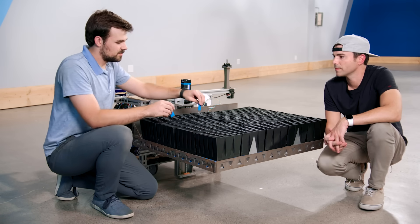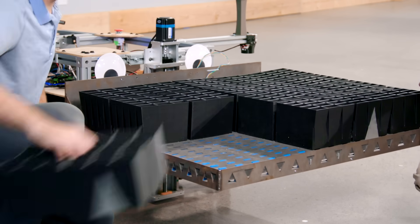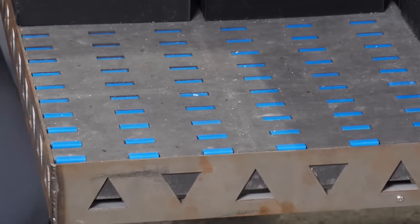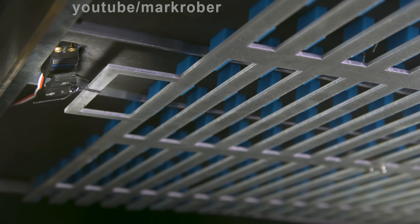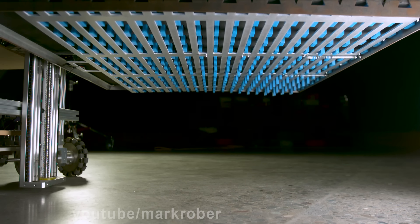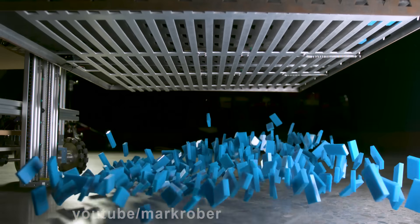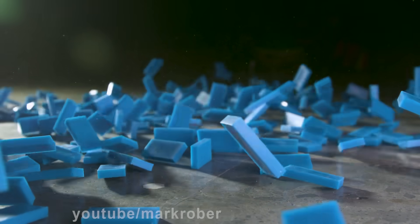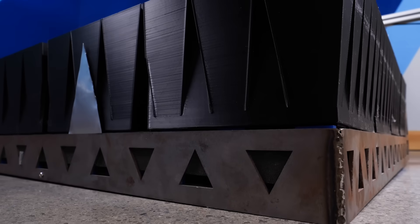The Dominator even double-stacked the middle row. That is seriously impressive. This technique of laying down a tile of 300 dominoes all at once was really the key that helped us crack the scale and reliability issues — and it's probably my favorite part about the Dominator, besides his wiggly tail. Here's Josh to explain more. We have these 3D printed funnels which allow us to drop all 300 dominoes all at once. If we remove the funnels, we can see the dominoes are precisely placed in their locations. They don't fall out because of what we call the Connect 4 mechanism underneath. But if we trigger the servo, it slides that Connect 4 tray over and drops them all at once, making for some gratuitous, beautiful slow-mo shots. We lower the whole platform down on a ball screw, then set them right on the floor, which turned out to be incredibly reliable.